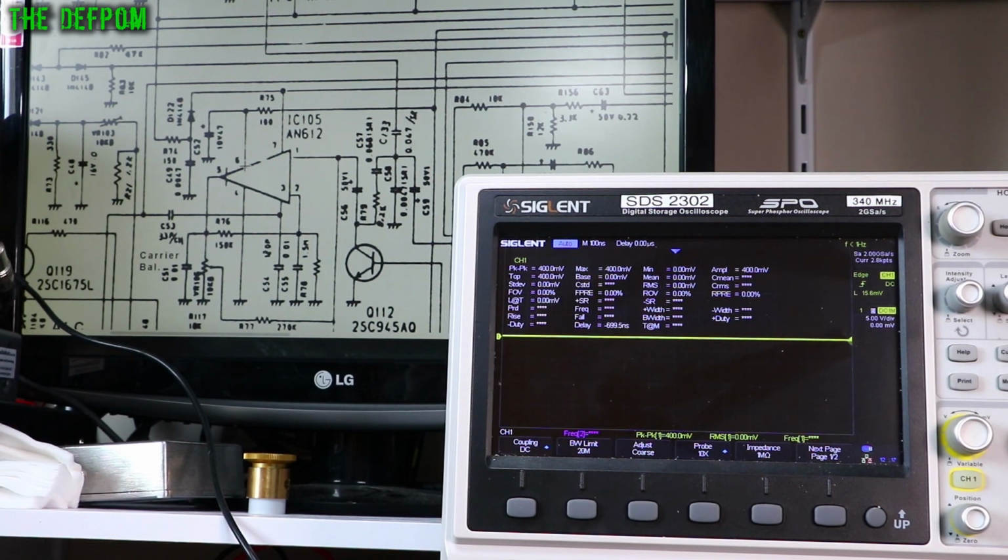I'll show you the signals I now get compared to what we got before, so we can see what it's supposed to be like. So if I go to D122, which is the output out of pin 7, so we're setting a DC offset there, transmit, there is something there. AM and FM are now the same, that's FM, that's AM. Go back to receive, just DC offset.